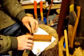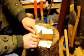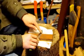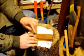Now as we're doing this, there are two approaches, and a purist will tell you, and not without merit, that the only way to get your knife truly sharp and to maintain the cutting edge is to use a curving stroke on the block. And the reason for that is, if you think about it, we're doing a series of straight little patches of grinding, and as we get to the bit of the blade that curves up to the point, they will become little straight facets with an angle in between. So the blade's not going to move quite as smoothly, particularly through wood, as it would do before.